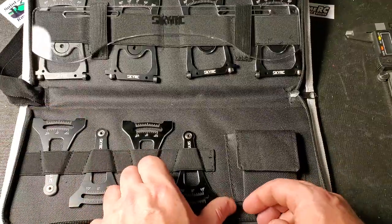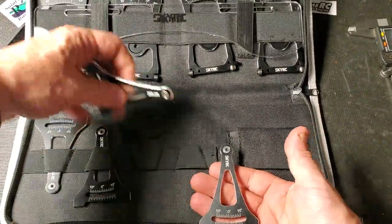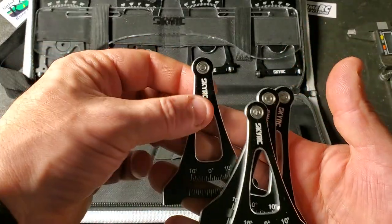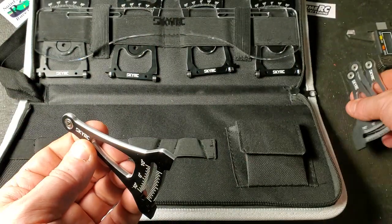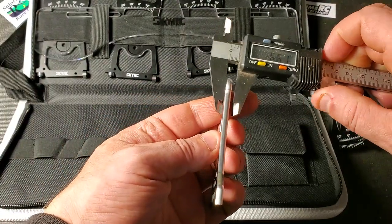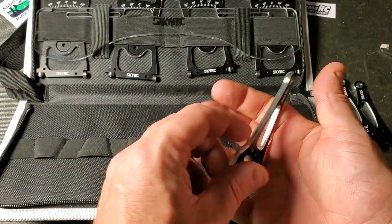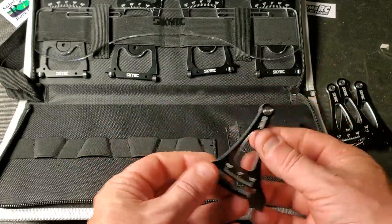You can see that all the different parts are individually held in place with a bit of elastic. These are the camber gauge parts — you can see that they are quite thick. Let me put on the caliper and just see. About 4.14mm, so about 4mm aluminum. You can see that they edged it and left it silver, black anodized.